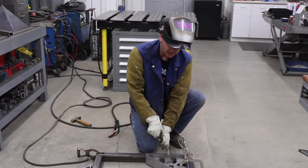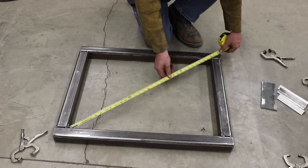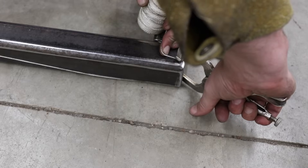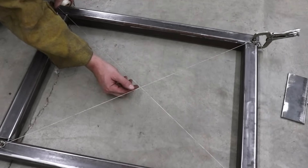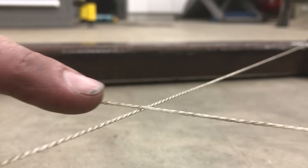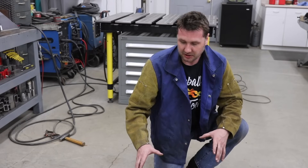All right, so it's something as simple as that — we got ourselves a frame. Now what we'll do, we'll test it. Looks like 31 and 9/16... looks like 31 and 9/16. If it was me, I'd be using fishing line because it's a little bit more accurate. Go from diagonal to diagonal, and what we're going to be looking for is the separation of the string in the center, and that's going to tell us if this square we've made has twist in it. You probably can't see this, but the strings — they want to be, they're trying to share the same space here in the center, and that's kind of what I want to see. It just barely touches on top of this one; I can see this string deflect a little bit, so I know that they're trying to equal out. So I know this thing's pretty dang good.